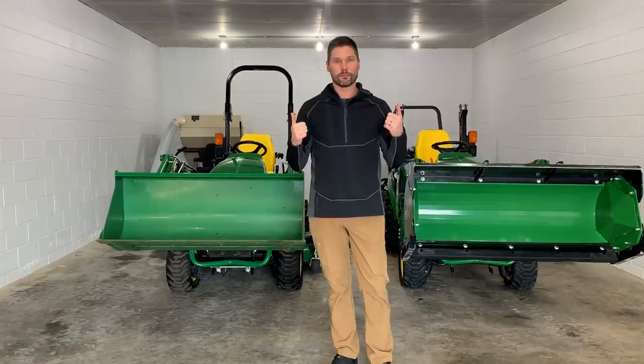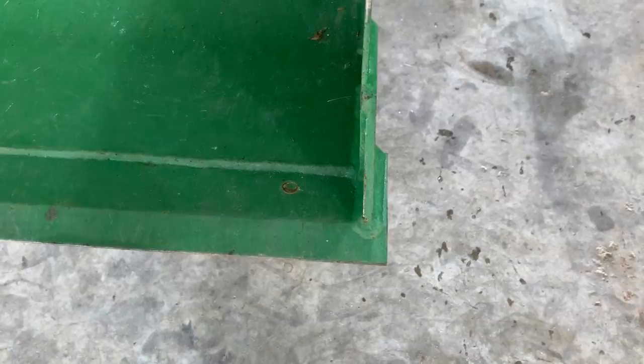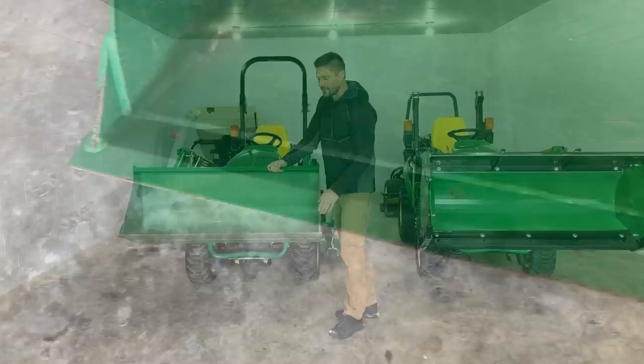So not only are you gonna cause damage to the surface that you're plowing, but you're also likely to cause damage, or at least long-term wear on the bucket edge itself, especially if it's not a replaceable edge. If this is an integrated edge like what this John Deere bucket has, you'll fairly quickly wear down these corners here and get them back into the side plate, and maybe wear down prematurely the front plate as well. And so you wanna think about that.